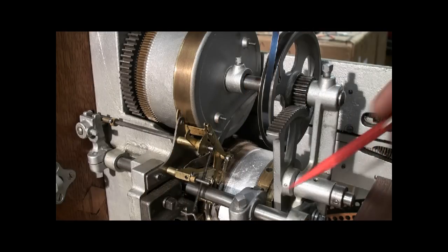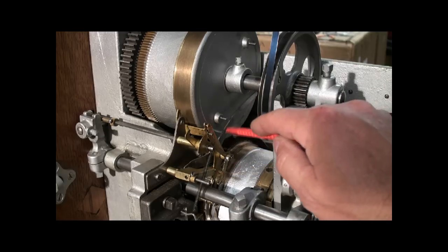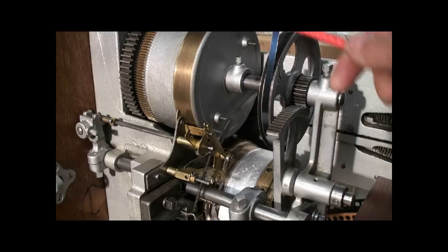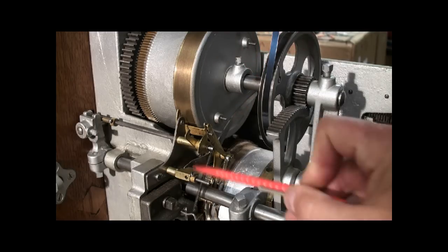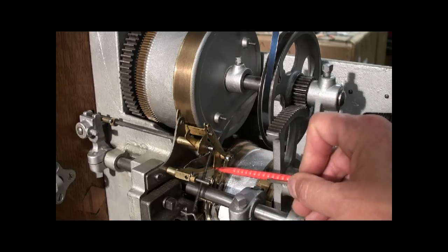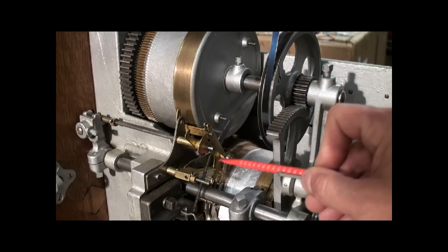So as the disc starts playing, this arm is pointing down and this lever is up in the air, or pointing upward. This motor will make half of a revolution to play one full disc. And as it does, this pin will rotate around and push back down on this arm. As it pushes on this arm, you'll see that this gets pushed back upwards, and now the spring tension, or the force of this, is pushing on the top side of this pivoting point.